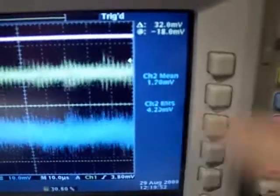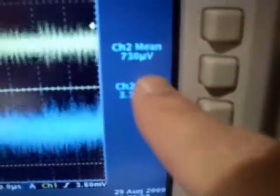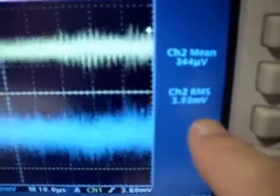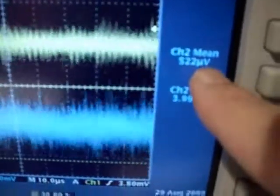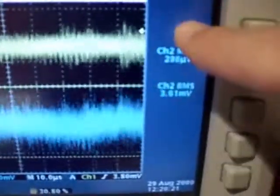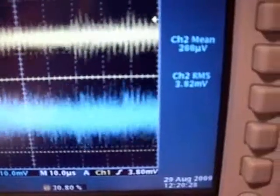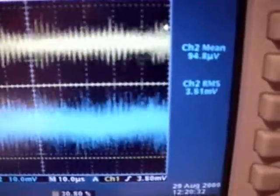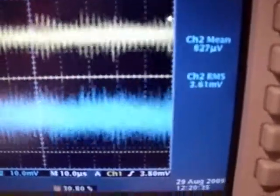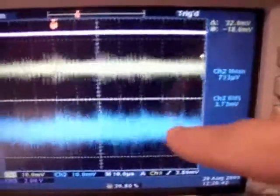Looking at the scope, the DC average being drawn between the load and timer is around 1.5 millivolts. I'm going to disconnect this yellow wire — the positive power — and you can see the DC average for the power shunt (measuring both load and timer) is now showing less than one millivolt, averaging about half a millivolt. We're now at a 3.75 RMS divided by about 0.5 millivolts, which is about a 7.5 times spread — much better.